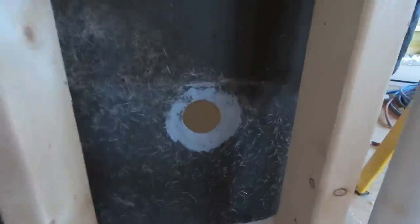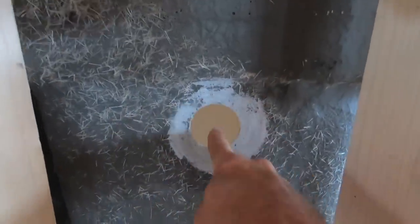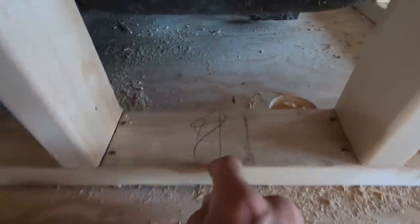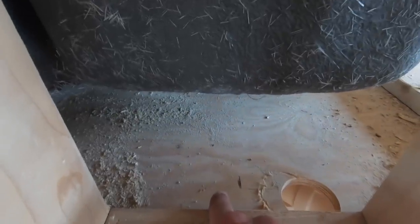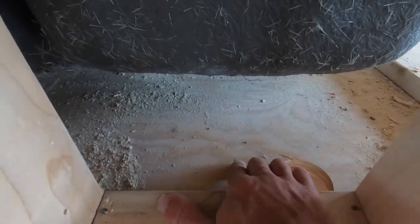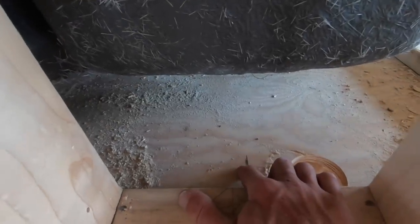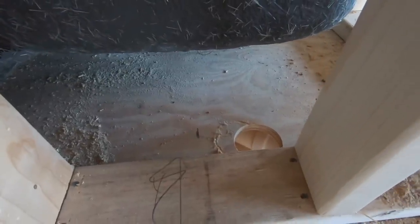So as you can see, here's the overflow, and right straight under there is the drain. Here is the center of the floor joist. The top of this floor joist comes to about right there, so you can see it's going to be in the way about by an inch. You don't want to cut through that flange, so what I do is do an offset, and I'm going to show you how to do that.